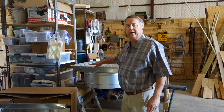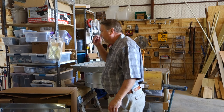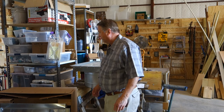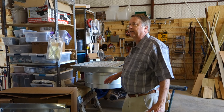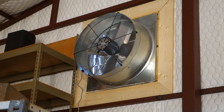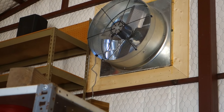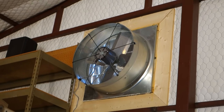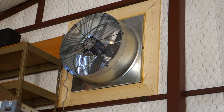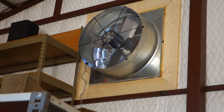So I bought two 24-inch exhaust fans. It's a Maxair IF24 — the 24 is for 24-inch — and they require a rough cutout of 28 and a quarter inch square. Today I'm actually going to cut the hole for at least the first exhaust fan and install it. I know I can do it because I'm putting in two of them and I did the first one already, and it came out real well, so I'm going to carefully go step by step as I put in the second one and show you how I did it.